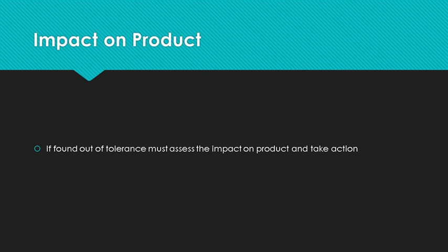You need to do some careful selection of measuring devices because this could create the need for a product recall. Some organizations calibrate to tighter tolerances than the product requirements. This allows the evaluation of the outer tolerance condition to determine if it has an impact on product conformance or not. Another method is to find current and previous lots controlled with the out-of-tolerance equipment and measure a representative sample with the device that is within tolerance to determine if the out-of-tolerance condition impacted product conformity. Any way the study is done, it will be costly and records must be kept.